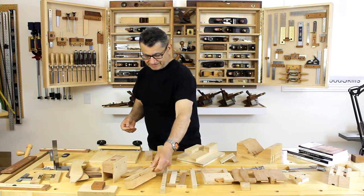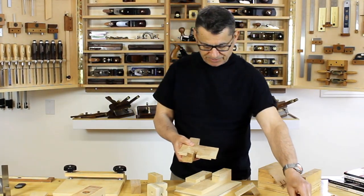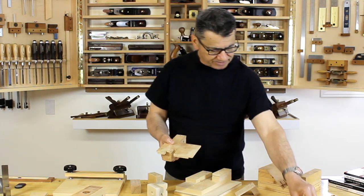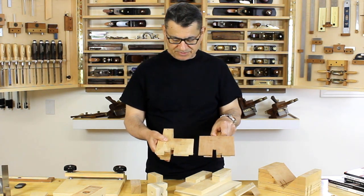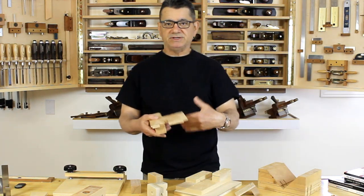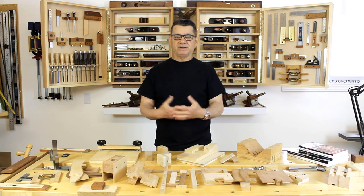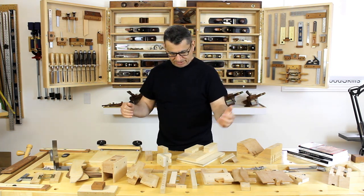Now here's another, a template jig for the quadrant hinge. And this is for the opposing corner. Now you'll notice one is a left and one is a right. So it's a pair, and this would create two openings for quadrant hinges, so I wouldn't have to use the standard hinges. I've migrated to quadrant hinges. These are some other template jigs I have.